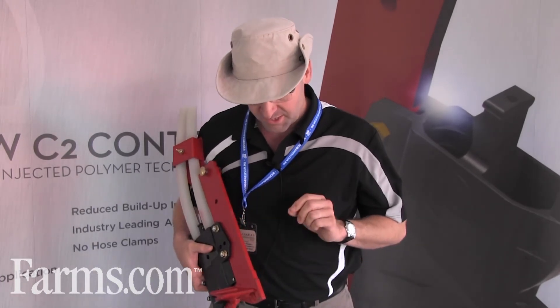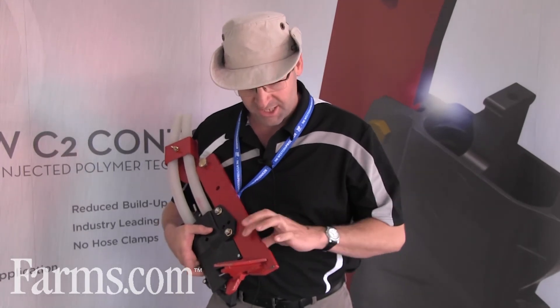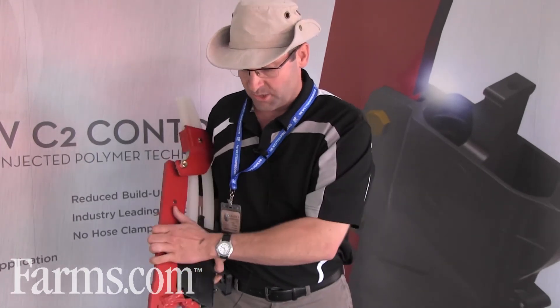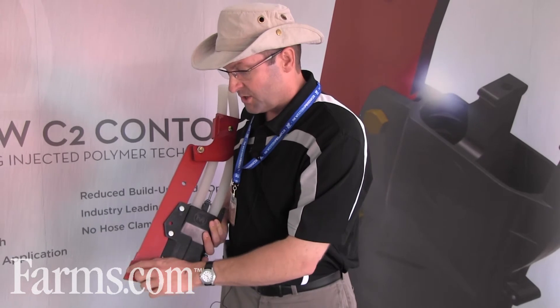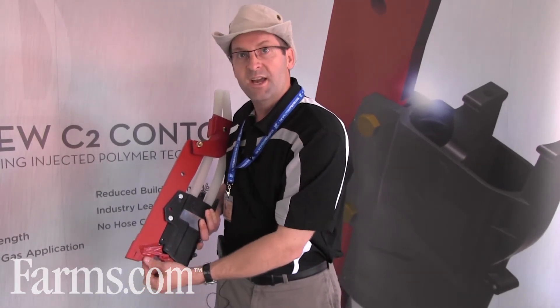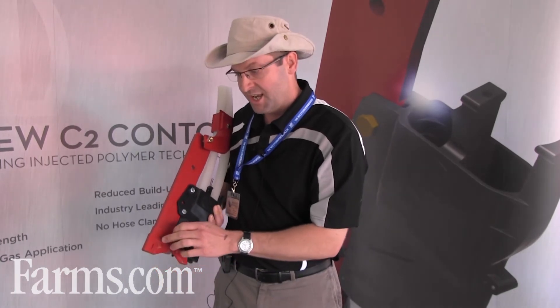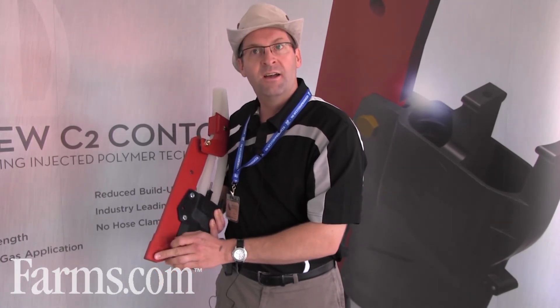On this particular opener, the high-wear regions are on the shank. There are carbide tablets on the front, but we were experiencing washout of steel behind them, so we've added a carbide tablet behind to stop that wear and extend the life. You need metal behind there — if it got too thin, the carbide tip would eventually break off, forcing a replacement.